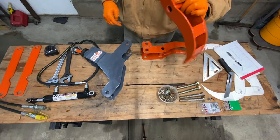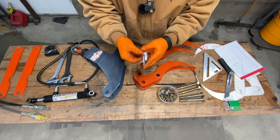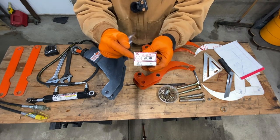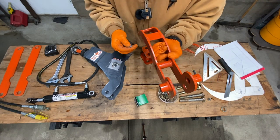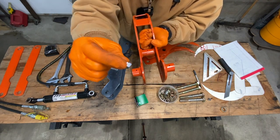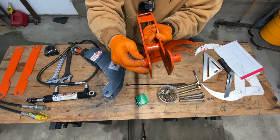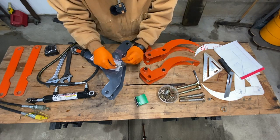In the video I mentioned drilling these holes, but luckily I had another channel — Joe from Steel2Wood — who told me about Zerk fittings. They're 1⁄4 by 28 nuts that he welds over the hole. So he welds these nuts and the fitting right over the hole — that's how he makes his grease fittings instead of just doing the hole. I plan on doing that upgrade. Thanks, Joe.